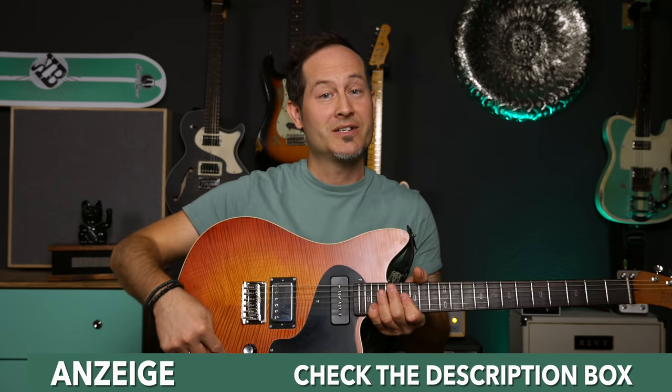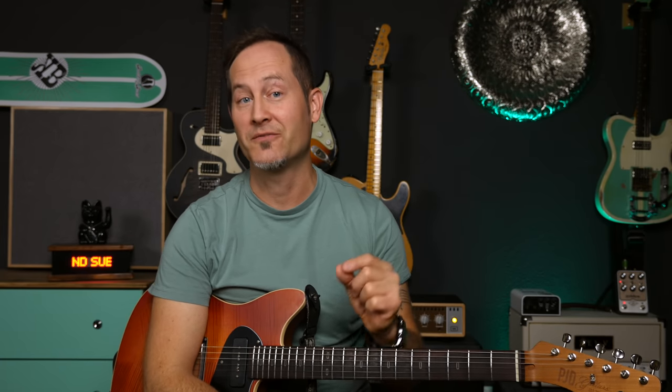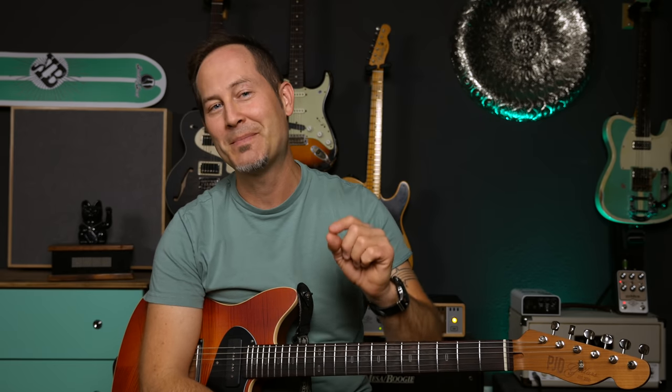A couple of weeks ago, I made a video on capacitors for guitars, tone knobs. I compared a vintage style paper and oil capacitor from Mojo Tone to a more modern and simple orange drop. Both officially rated 22 nanofarads, which is something you would see in humbucker and P90 loaded guitars most of the time. I didn't measure the capacitors in that video, and a lot of you guys criticized that in the comments.